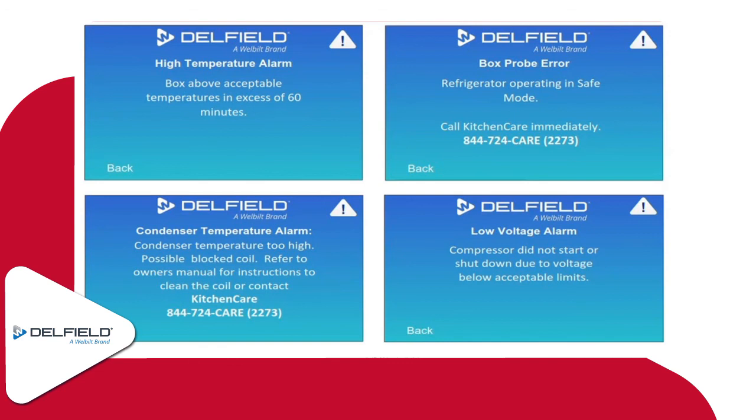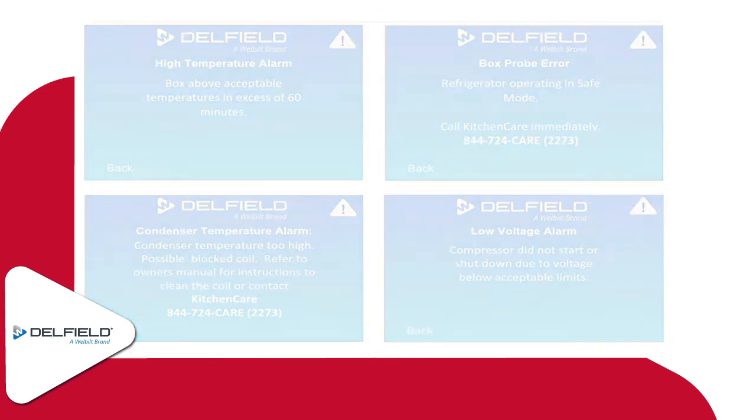And then low voltage alarm. You'll notice it says here, compressor did not start or shut down due to the voltage being too low. There is a low voltage threshold. It's 95 volts. Up to 145 is the range where it'll work, but if it gets above 145, it'll actually kick off a high voltage alarm. So just something to be aware of there as well. It holds out the condensing unit until that voltage issue is corrected.